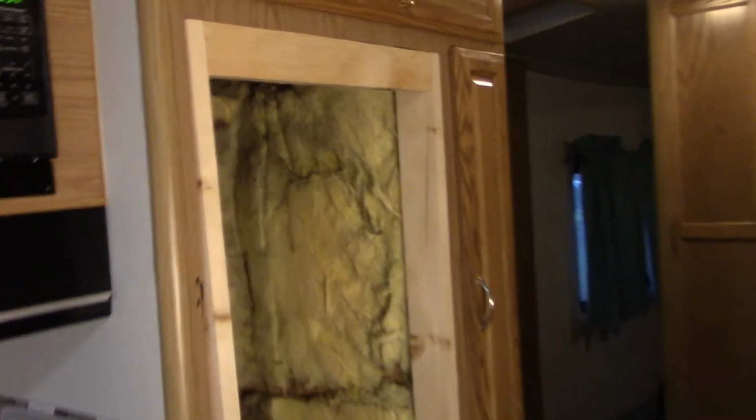So just to give you a quick look at what I'm doing. I'm building out the 2 sides and the top so that the opening is the dimensions that are most appropriate for the new fridge. I'm using 5/4. This is actually 1 1/8 thick. I had thought I would put 1 1/4 on each side. This ends up being 1 1/8. But that's okay, that way it won't be too tight and I'll be able to get it in without too much difficulty.